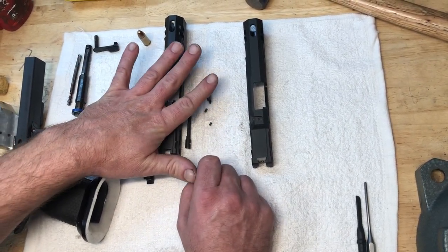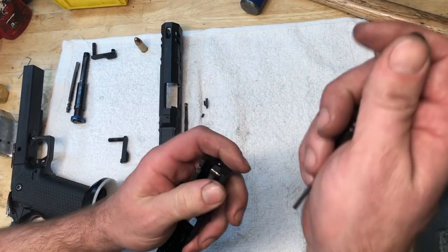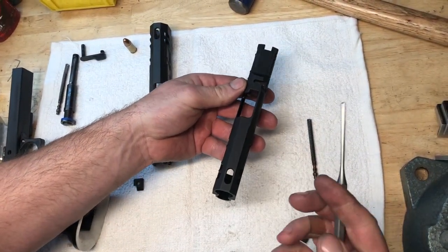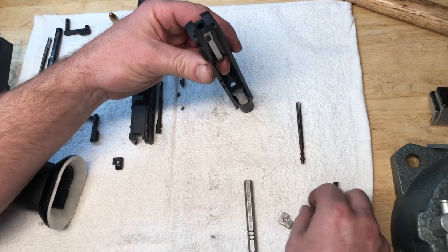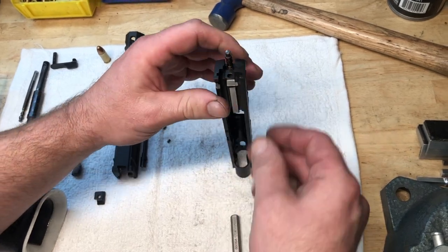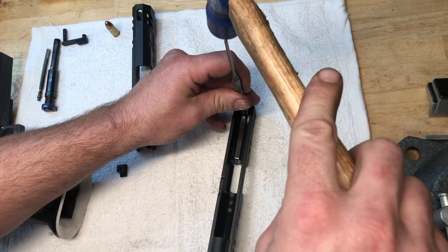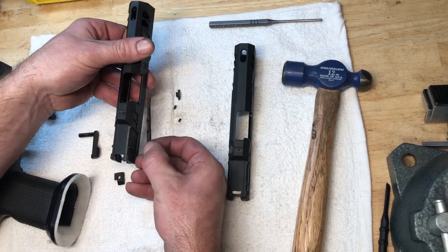We used to use this one exclusively, so I'll show you how to adjust this one at the end. We don't use it anymore because we've had some problems with them. The newer style — which almost everyone runs if you bought any generic — they're just running tool steel, made out of the same material as the slide, 4140. Both of these are service items. They're both going to need some adjustment over time. These are not something that you can set and forget for 10 years or 100,000 rounds.